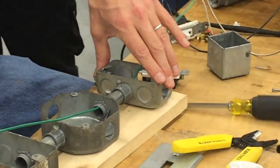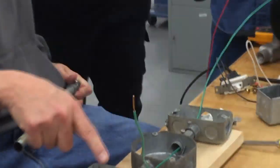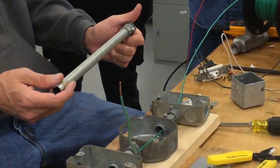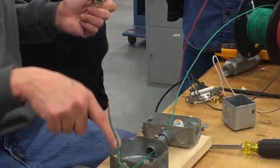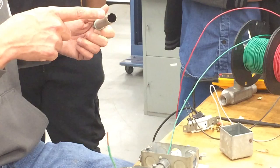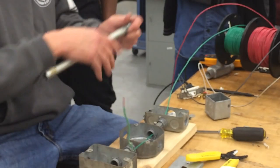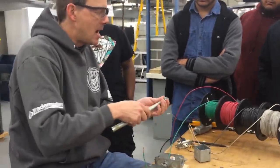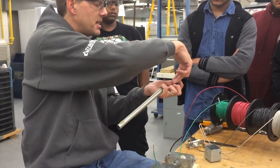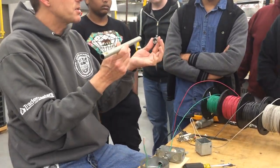You're going to need a ground going through all three boxes. Technically, this is your ground. They don't even really need to run a ground when they run all these metal boxes in EMT, because if they connect the ground here at one box, and all these connectors are tied in tight, then they're connected together — they're bonded. But what happens if some kid comes along and loosens up a screw, and the strap comes off, and this pipe pulls away from the connector, and the box is grounded over here, and all they see is these wires sticking here — there's no ground. We've lost our bonded box.